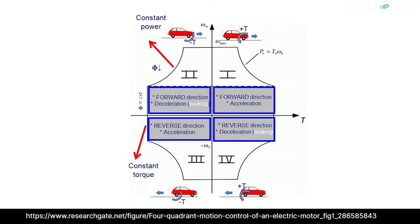However, this system may not meet the entire braking requirements of the vehicle, so it is used along with the friction brakes to bring it down to zero speed. This is because at high speeds, the machine does not produce sufficient braking torque, which it can produce during acceleration from zero.